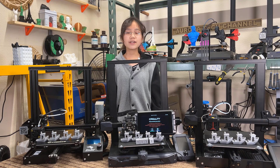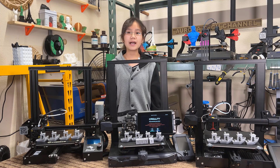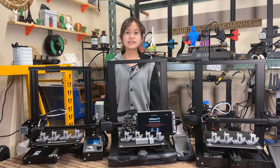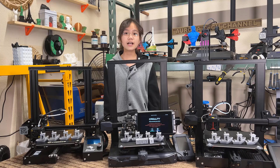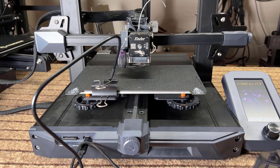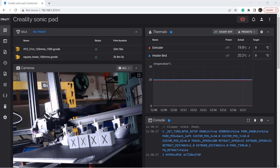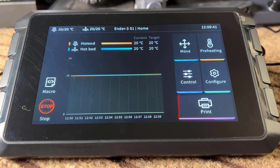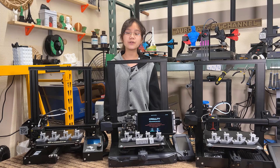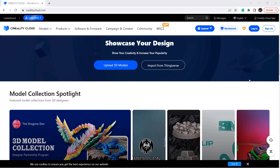In conclusion, integrating the single board computer and touchscreen in one single tablet at a reasonable price to run Klipper is much easier and cheaper than getting a Raspberry Pi and an external touchscreen. The installation of Klipper firmware on supported printers is quite easy even for beginners, but it still has some missing features like calibrating the input shaper from the print bed and pressure advance, which you need to do using the WebUI console. The WebUI and Screen UI is a standard Fluidd and Klipper screen. Creality just added a Cloud button inside the print menu, so if you like using Creality Cloud you have an extra option, but if you don't, you can just leave it.